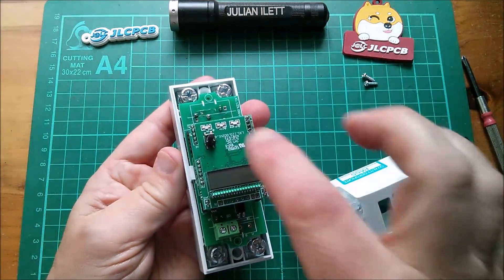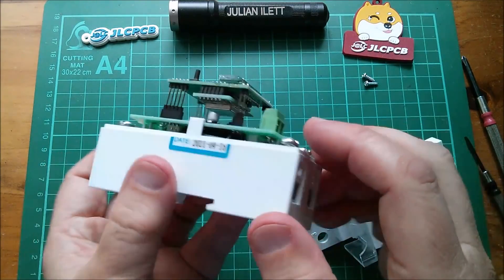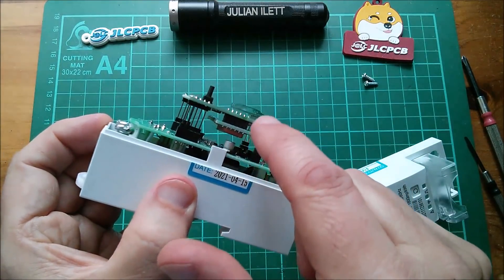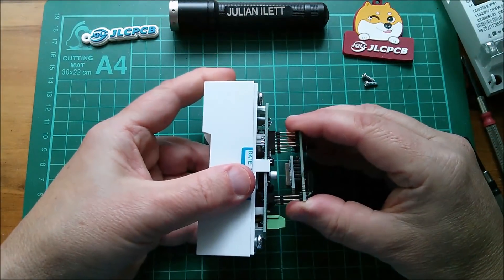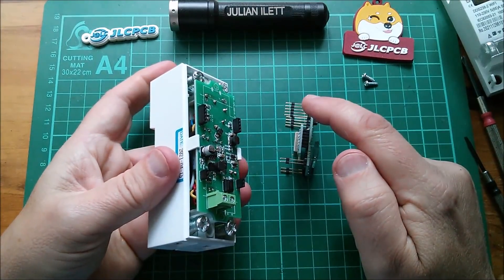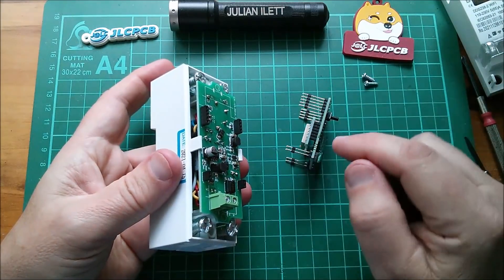So there — that's an LCD, that's the button for the little switch, we've got three LEDs, and then this daughter board which also appears to contain the Wi-Fi module slung underneath. It should come away from the main board on these little — well they're not 0.1 inch, they're probably 2mm Dupont style pins.